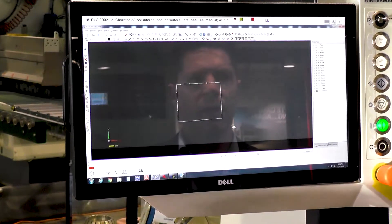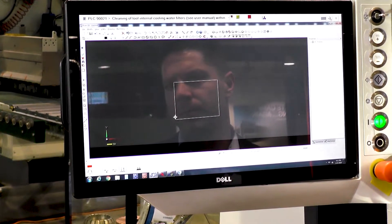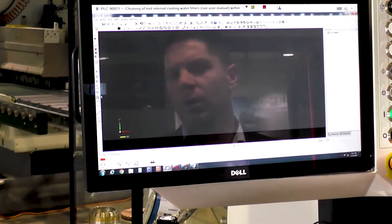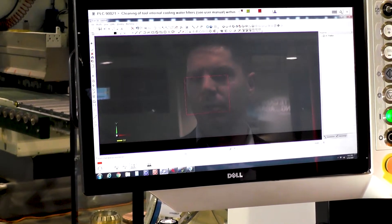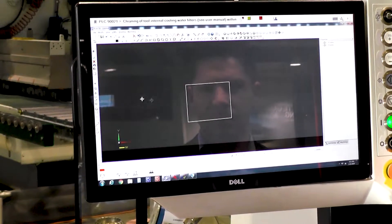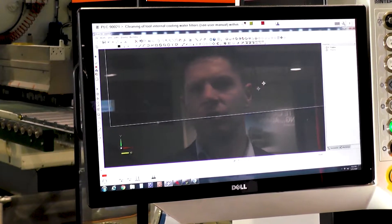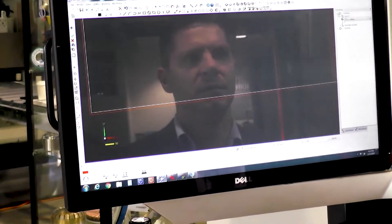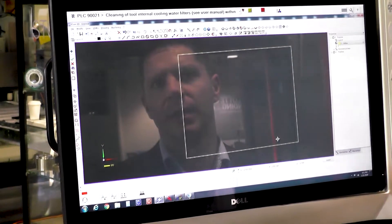So what we're going to do now is create what I consider a footprint. We're going to run a line from here to here and offset that so with the saw we'll have two millimeters of over material. I want my copy on so I have my before and after. I'll change the color — this will be the over material and the white line will be my final dimension.